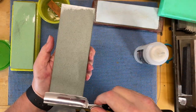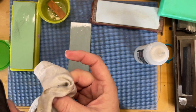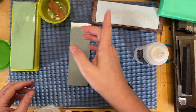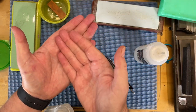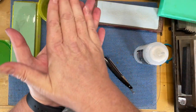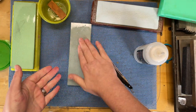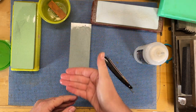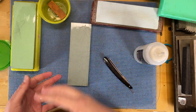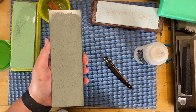So as you saw, I did finish on some strops, stropping strokes. I will tell you all, even though this is not a tutorial series video, if you are sharpening a straight razor, when you start getting into the higher grits, it's kind of good to do that edge trailing stroke a couple times. That super, super fine edge, as you're cutting, is hitting into the abrasives that have built up in front of it, especially if you're using water stones that are building a slurry. If you're doing that edge trailing, you're pushing all that stuff out of the way and dragging it backwards, so you're not hitting into it. The majority of it is done as an edge leading stroke, but the final few passes on the next three stones are always going to be edge trailing, almost like stropping, just to make sure that the final little bit of that edge is not being knocked into by the abrasives.